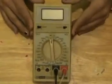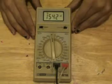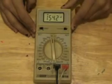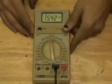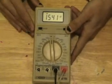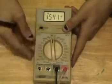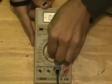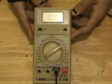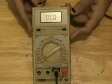Here we have a relatively ancient multimeter. I do not know where this thing came from — it's probably as old as I am, if not older. It's got a four-digit display, relatively nice. Granted it's old, it's still usable. It does actually have both an auto and a manual ranging system. If I put it on auto-ranging, when I take the probes and put them on a component, it'll go through the range of values until it automatically selects the proper one, or you can go to manual and go through the typical settings. The drawback to auto-range is it takes a little while for the meter to get an accurate reading, and with only a three-to-four-digit display, it's not going to be super accurate.